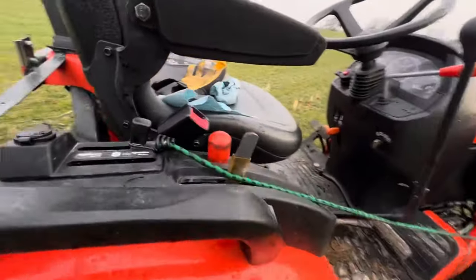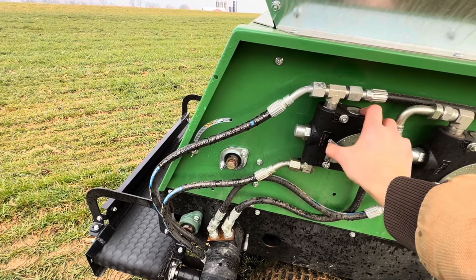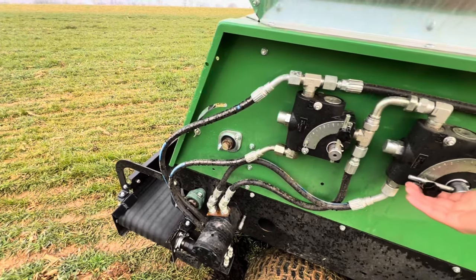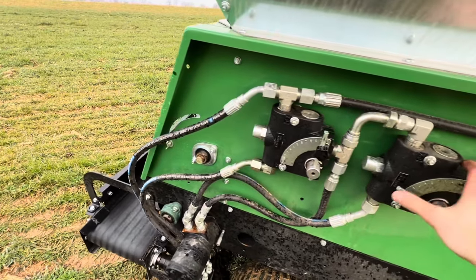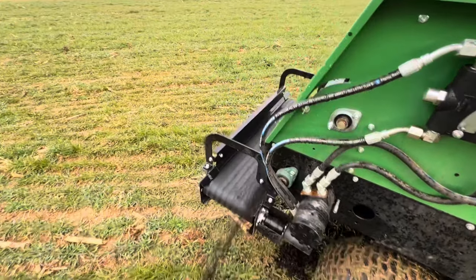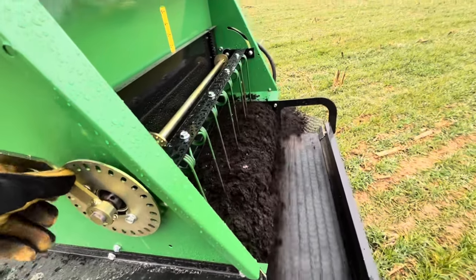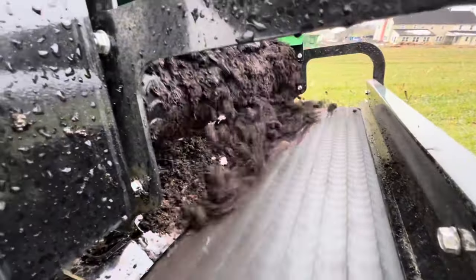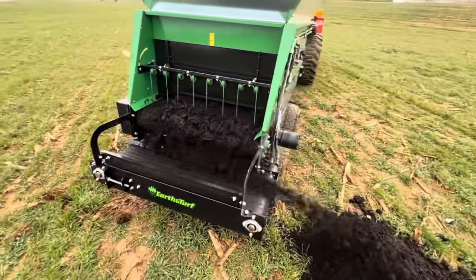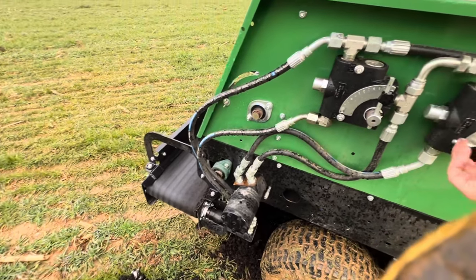Let me give you a little bit more throttle. We've got a little bit better flow. So that's going to be stopped at setting two. We're going to go to three, four, five, and then all the way up into ten. At some point you're pretty much just wide open and it's not going to change a whole lot. Then I'm going to move this control up to maybe two — nothing there — going to go up to about four. There you go, starting your flow. Almost nothing coming out because of the end gate. If I open this gate more, that's going to allow more flow, more material. Then I'll come in here, slow down the main belt, and all of a sudden we're not spreading. That's really all there is to it — super simple system.